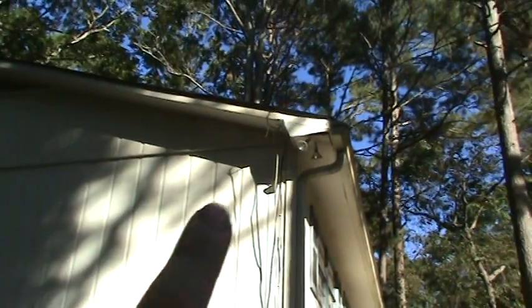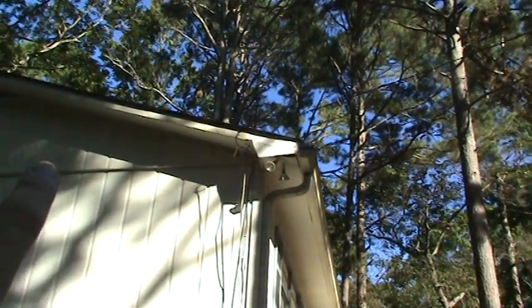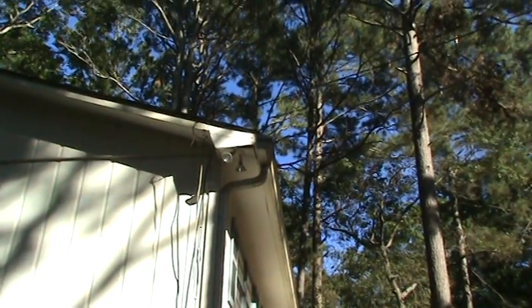Like all homeowners, she's had some issues with repairs. Someone came in and made a repair here on the left corner of this dog ear in the fascia board, but we're going to have to remove that fascia board because they cut it short of the rot that's right here in the center. We'll extend it out past this little guideline for the phone wire.